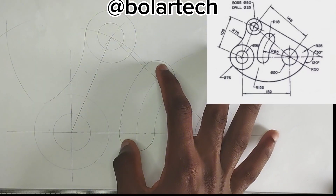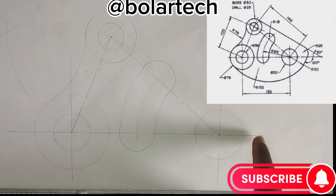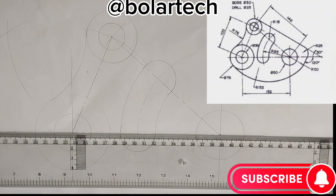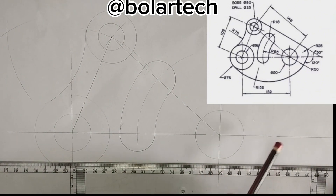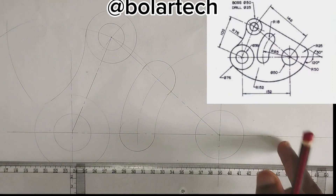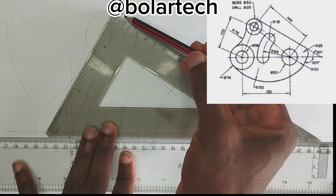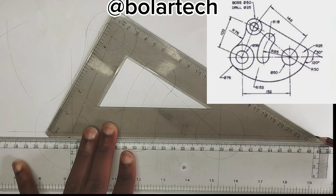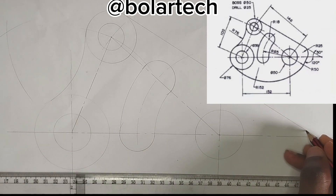So that's for this particular place. Now, as we can see in this place, there is a line that is joining to this horizontal line which we have been given on the screen. As we can see, that line is having an angle of 30 degrees at this particular point. So I'm going to place my compass at this point here and draw like this, then draw like this. This is an angle of 30 degrees.